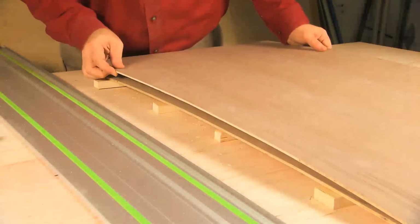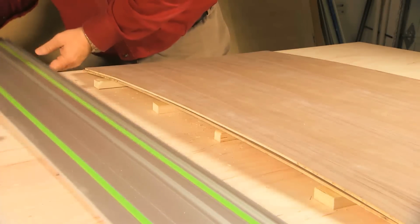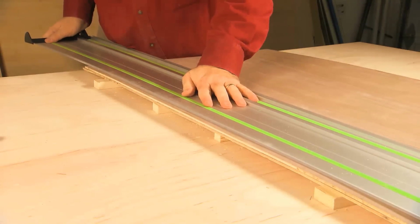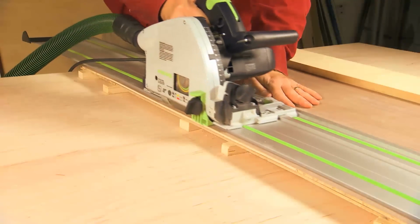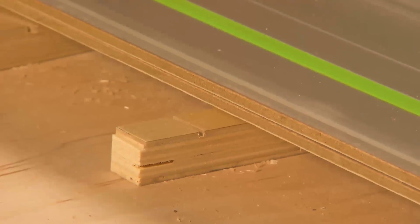The 8-foot-high wall, it ran about 20 feet. And my boss had promised the homeowner that it would be seamless mahogany. What we ended up doing was getting really high-end mahogany. We'd back cut an actual 2 to 3 degrees on the leading edge so that we had a zero bump zone, if you will. And then we were able to just tune it in.